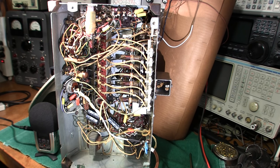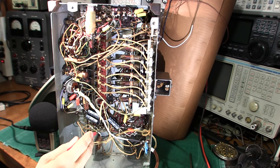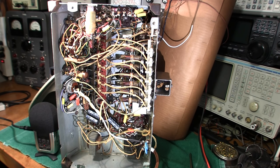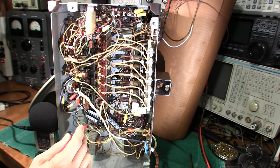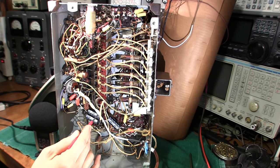The electrolytic capacitors are also very important to replace. If you've ever turned on an old amplifier or old radio and got a horrible loud hum from the speaker, that's because these capacitors are open inside. These are replacements — the originals were probably in a cardboard tube, likely a multi-cap. These were all replaced with 450-volt 20-microfarad capacitors, which is absolutely fine. Make sure all the electrolytics are replaced as well, because no questions asked, they have to go in these old radios — if they're not faulty yet, they will be.